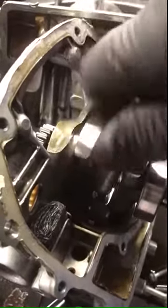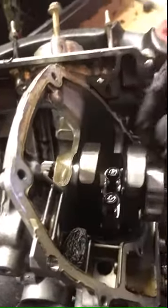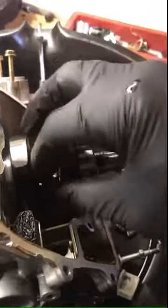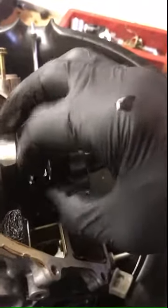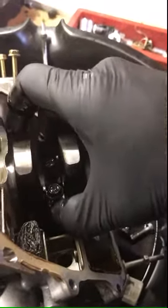Problem with this engine, it was smoking a lot. It was running pretty good, but the oil consumption was pretty high. And I'm gonna find a solution if I can. I got some parts from Honda, and I'm gonna try to replace the piston rings where I think there's a problem. Hopefully that will take care of the issue. And also gonna put a seal for the intake.